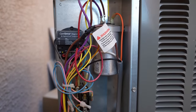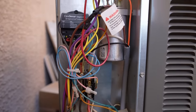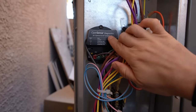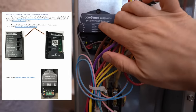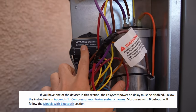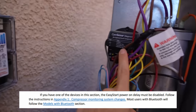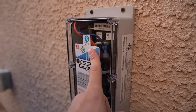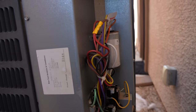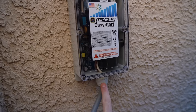When you first look inside it's a little intimidating if you're not used to seeing bundled wires, but it's very simple. First, the instructions want you to find a diagnostic module — this one's called a CoreSense Diagnostics, but there are a couple others mentioned in the manual. If you have one of these, there are extra setup steps: I had to connect it to 240 volts, change the settings, disconnect from power, and then install it. On the second air conditioner there is no module, so I could take it out of the box and install it directly. The soft starter can be mounted on the wall, somewhere inside the unit if there's room, or nearby — just ensure the connector is facing down so water will not get in.